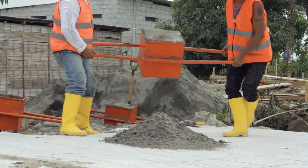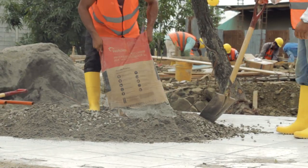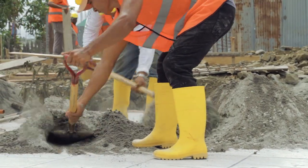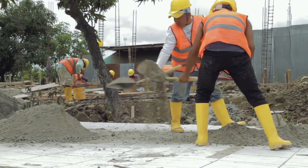If it is done by hand, the following steps must be followed. One: make a pile with the gravel, the sand and the cement, but without water. Two: mix the dry pile by shoveling it to a new pile, and repeat this by shoveling it back to the first pile, ensuring good mixing.